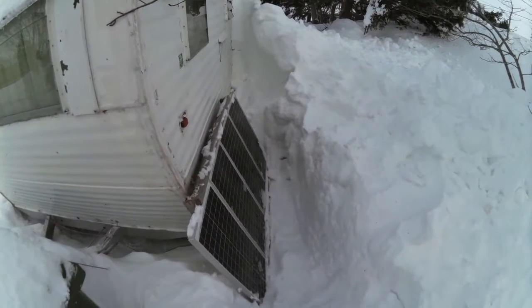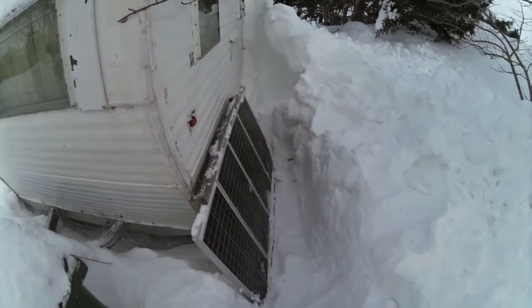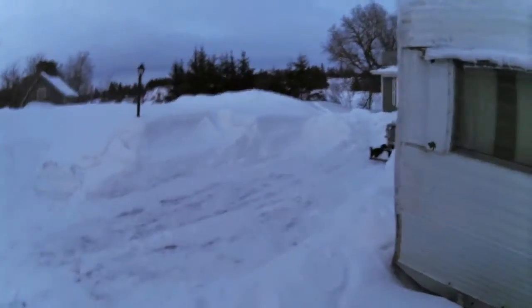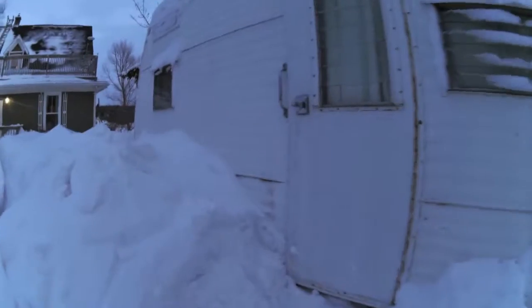Unless you completely disconnect your battery at top charge and nothing drains it, then you might be okay for a while, but it still loses energy. Just a note to clear your solar panels. I'll show you the inside here — it did get up into a bulk charge. It says 13 volts. It's not taking or losing any amperage right now, though it's still drawing a tiny bit. 13 is good — it was down to 12.6 before I got the snow shoveled off it.